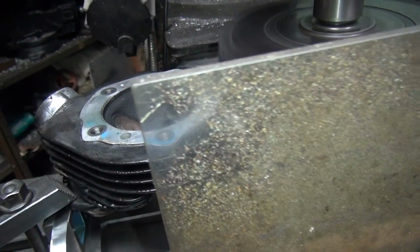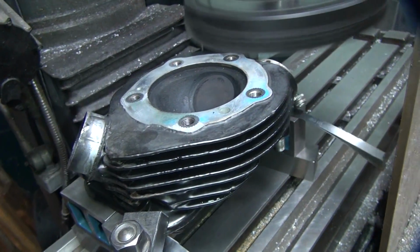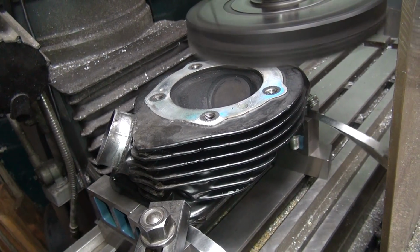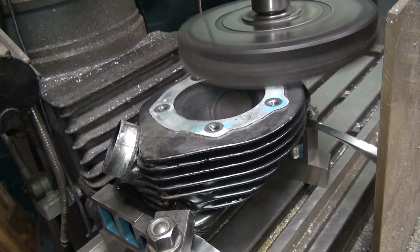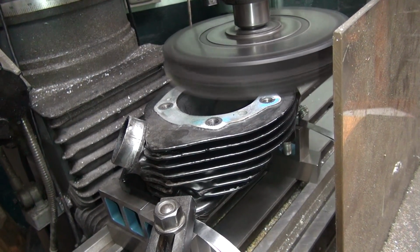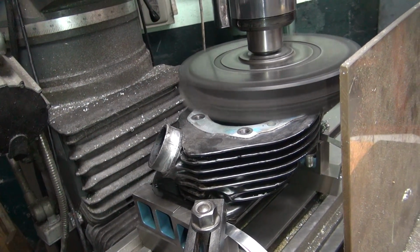That's going to cut heavy by the time we get over here. Look at that, 1,000s. See what happens. It's going to cut a lot when we get over this other side. So where's your pad at? Yeah, there's that. We're cutting. We're not cutting by much over here. This is kind of a lousy cut. There we go. Now it's digging in. High spot. That's not even an even high spot. Way high spot. Yeah, that's a crappy high spot. There we go. We're hitting heavy on that corner. Now we're going to start cutting.